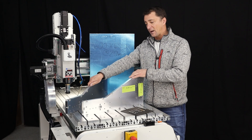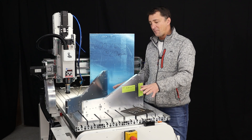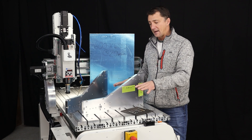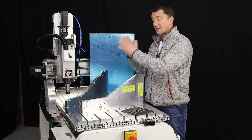What I would really like to achieve is to be able to make six at the same time on the Exec. But before I commit a big piece of stock to the machine and to that specific process, I would first like to see how it performs and then adapt my toolpath strategies so it can cater for this specific machine.